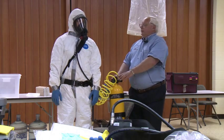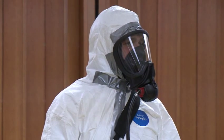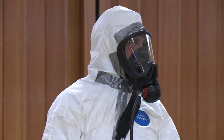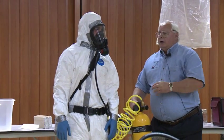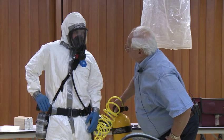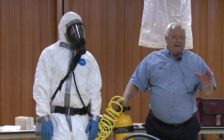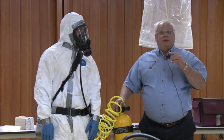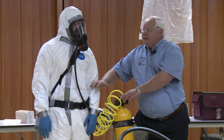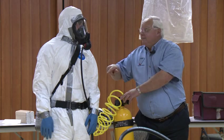Now you feel real comfortable. You're breathing nice. How you doing? Everything fine? It's starting to get tight. Do you have air? Can you breathe? No. So you need air? So I need you to go to the emergency bottle then if you're having a problem. You have to turn it on. Kind of hesitated — not sure where he's at. Go to the emergency bottle. So he's looking over here. Is this it? No, so we go over there. He did remember palm down, so you're right dead on the money to turn it on. Turn it on. And there you are — back in business.